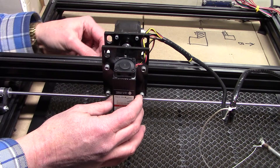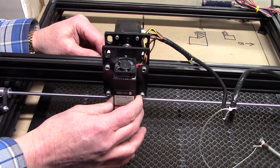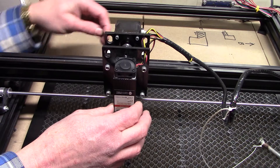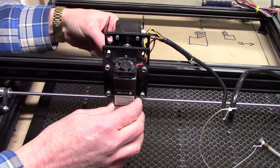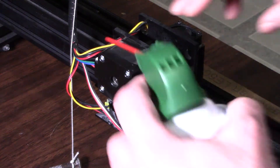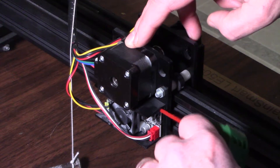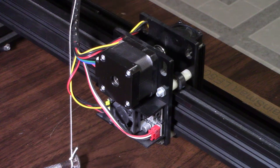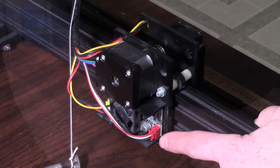There we have the power back on. It's at the bottom of the plug, which happens to be the black wire. Taking a look at the laser control board I noticed that it was pretty dirty so I got some compressed air and blew that out. On that red plug there's a red, white, and black wire and it's that black one that seems to be the issue.